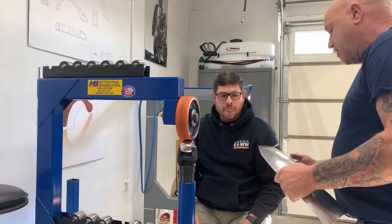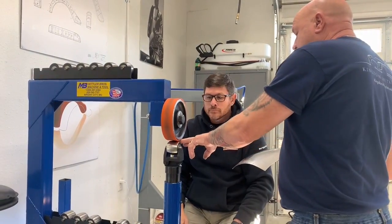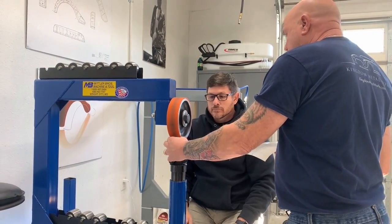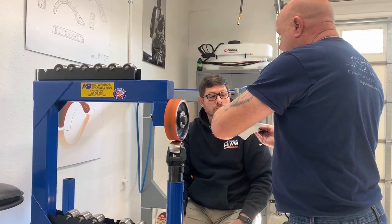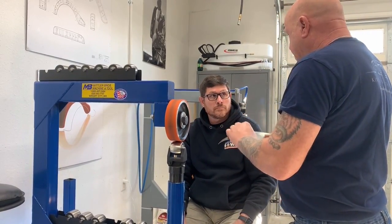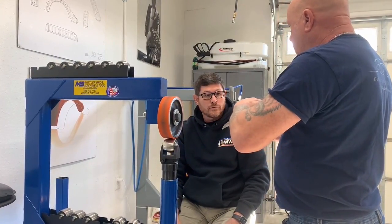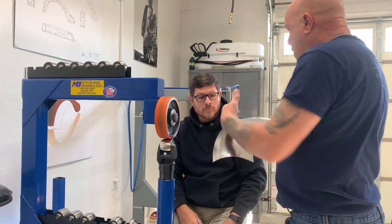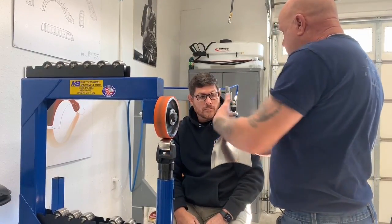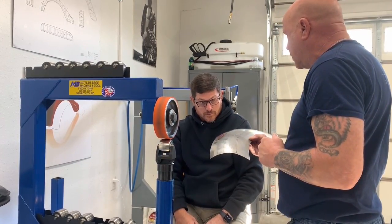And it doesn't matter if you put more crown or not. But I want you to get the feel of how much pressure you've got in between the wheel here and the rubber to how much curvature you're putting in. You don't want to rib it. It's very easy to rib the panel with the rubberized wheel in. Okay. So we're using very light pressure with lots of passes to keep coming backwards and forwards and backwards and forwards, and it will give us this consistent curve.